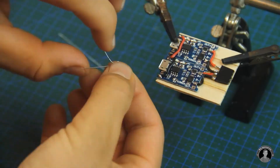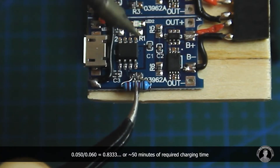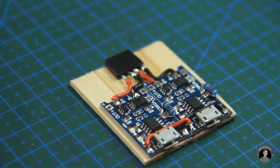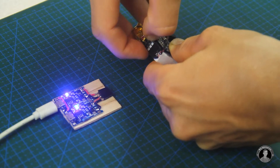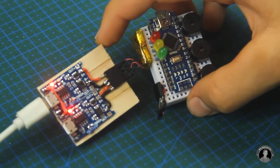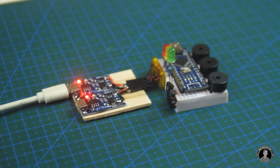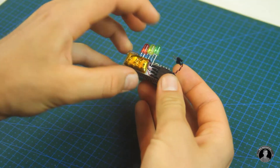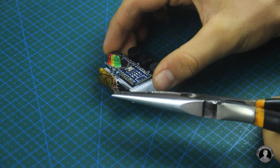We can disconnect the battery from the device and plug in the four-pin header to the charger, turning on its red lights, indicating that the cells are individually being charged. These should shine blue when fully charged. Plugging the cells back into the gadget, we now have a fully charged battery pack of 8 volts and a capacity of 50 milliamp-hours, lasting the device nine minutes of runtime, or about 36 song replays.